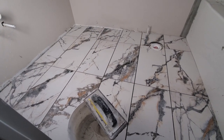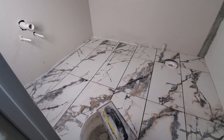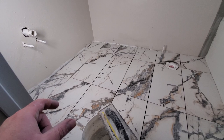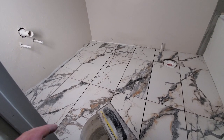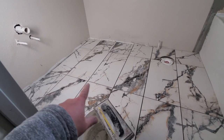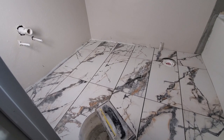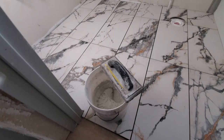And there you go. So you saw, I went ahead and I took off all the little tile spacers. So the black spacers that break off, those go into the trash. And the red spin-on tops, those can be reused. Those go back in the box. I can use those for the next time. And I got the utility knife and cleaned out all the little lines there between the tiles. And got that vacuumed up and cleaned everything off with a sponge. Got everything looking nice. And now I have my grout here.